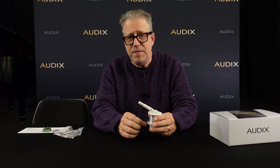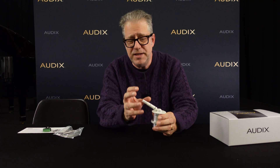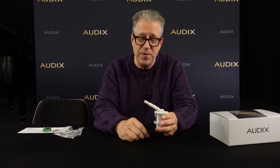The M45's miniaturized shotgun characteristics allow for a phenomenal micing area in a classroom, lecture hall, or public meeting space. This microphone allows you to microphone an area approximately 10 to 15 feet wide and up to 25 feet deep, depending on the acoustic environment that you're microphoning in. So the M45 allows for a pretty big area from such a little microphone.